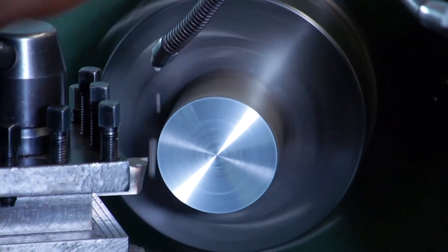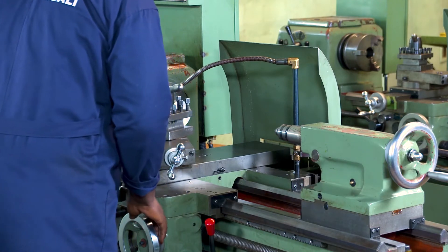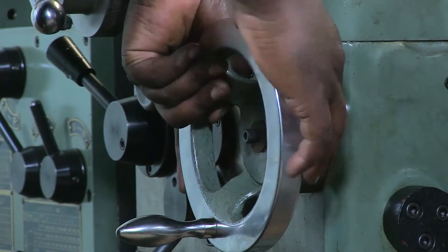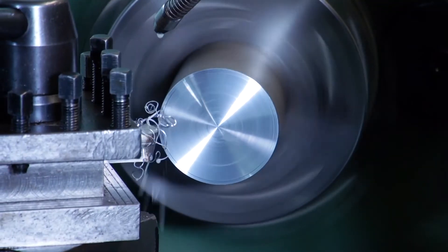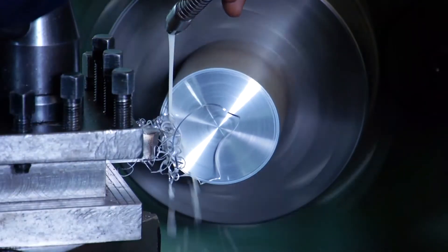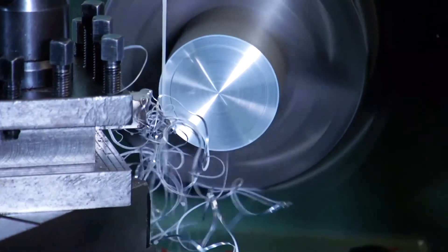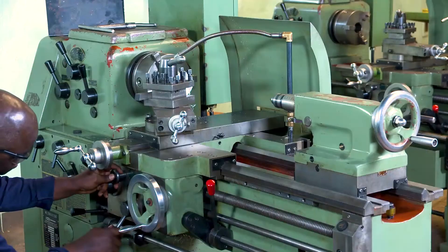Now let's start. First of all, I touch on the surface, then I leave the surface. I can set this micrometer of the carriage at zero. Then I will know if I feed to a distance equal to 1 millimeter. Now it's time to use this cross slide. I put a little bit of coolant. The coolant must be between the workpiece and the cutting tool. Remember, if I want, I can use the automatic motion. If you want to use the automatic motion, you check the different commands here.